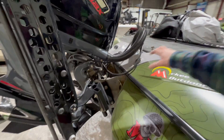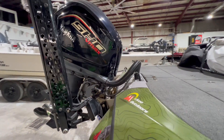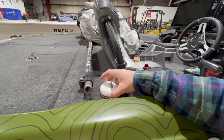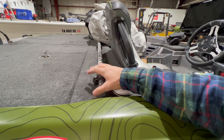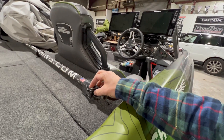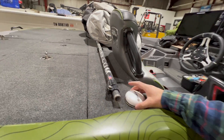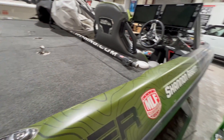On some model boats you can mount them towards the back of the boat. You don't want them within three feet of the motor due to magnetic interference. And since there is a compass in here, it is sensitive to any ferrous metal, so you want to be aware of that. Anything that a magnet can stick to — like this pole — if this hardware was ferrous, it would actually give some deviation. So when you place these antennas, that's a point of emphasis.